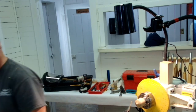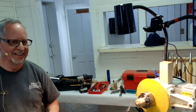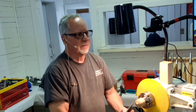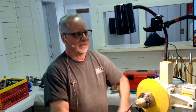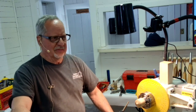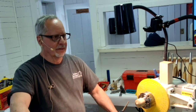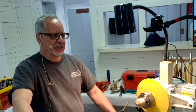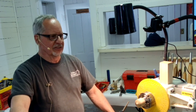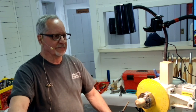Anyway, anybody have any questions? Anybody have any questions about anything else to do with turning? Back to this morning, when you put the file in the oven, what temperature? 425 degrees. It's not critical. 400 to 500? Well, say 400 to 450. You start getting up toward 500, the metal's going to get too soft. For how long now for each? A half hour per quarter inch of thickness. So what I do, 99 times out of 100, the steel that I'm using is right around that range. So I throw them in there for a half hour, forget it, and it works fine. Seems to have anyway.